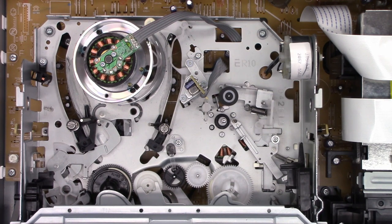So I'm wondering, is there something binding this unit? Is the bushing just failed? I'm going to have to pull this thing all the way back apart, take out the two screws — the plastic one and the machine thread screw — and see if something got folded over under the capstan motor that's binding it up. I may have to unsolder the ribbon cable and actually remove the transport from the chassis.